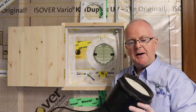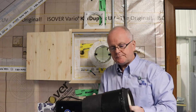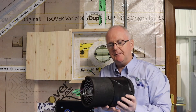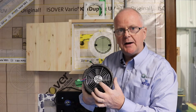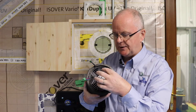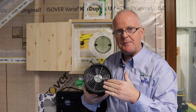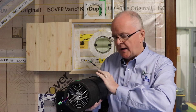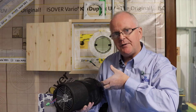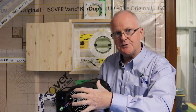I've got a very interesting device here which I'm going to insert into that hole in the wall. It's actually a heat recovery ventilator, which is really interesting. There's a very small fan in this ventilation system, and the interesting thing about this fan is it changes direction every 70 seconds. For 70 seconds it's drawing warm air out of the house, exhausting it, and then the fan changes direction and brings fresh air into your house interior.